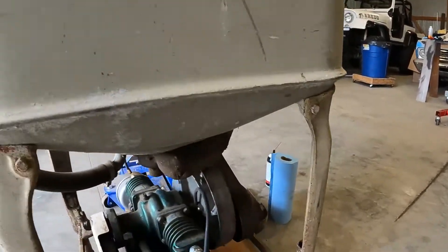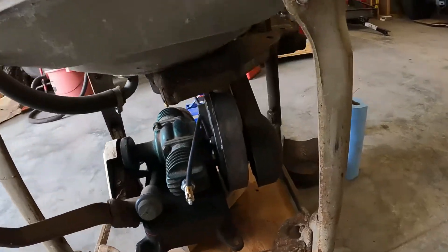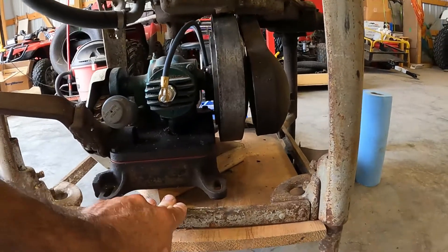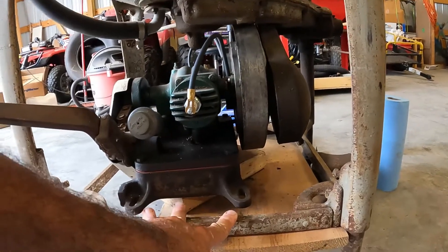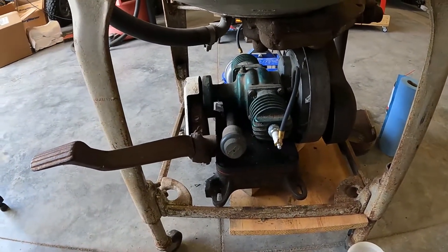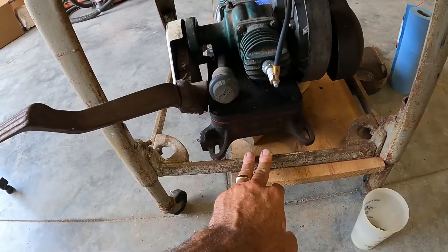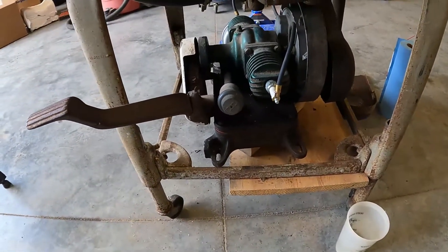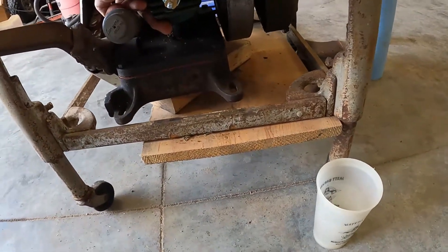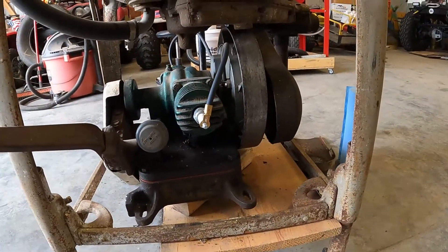Our issue is this: we've got a sizable flywheel on our engine, which I'm okay with and we're going to leave it. But that interferes with the gearbox of the washer a little bit. We'd like to mount this on top of this rail — that's how the electric motor was attached, on a board on top of these cross members that keep the legs together. But the thinnest material we have that we're okay setting this engine on is a quarter-inch thick plate steel. If we go a quarter inch above here, we can't slide our engine back to where it will kick. Where we can get the belt on correctly, we're going to have to come up with an alternative.